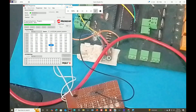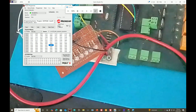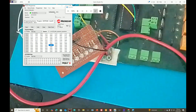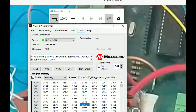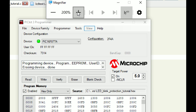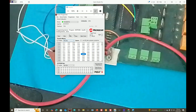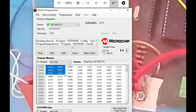The LED is blinking as it should — perfect code. Now to verify we're doing the right thing, I try to read the code. I click on read. See — the code is read and we get the data. We should not be able to get this if it was read protected. So the problem is that we need protection that will not allow this data to be read.